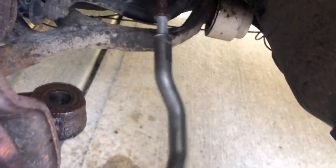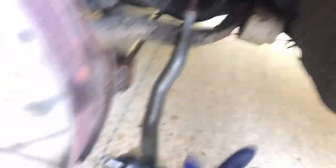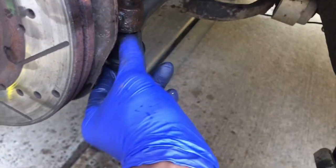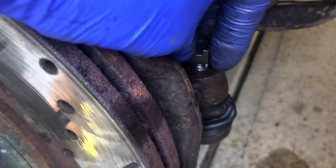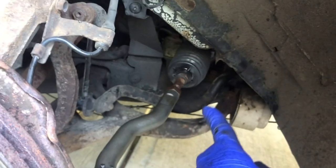So the new one, we're going to screw it on, just like we screwed the other one off. Remember, we're only going to screw it back to the point where we barely broke the jam nut off, because we don't want to knock this out of alignment. It's just about screwed in — ours goes from the bottom, so we have to place it back in from the bottom like it was. This is going to slide up through here and then I'll put the crown on. We apply this with a new crown, just tighten this on — we're going to place it on so it doesn't move. Next we're going to tighten the jam nut back.